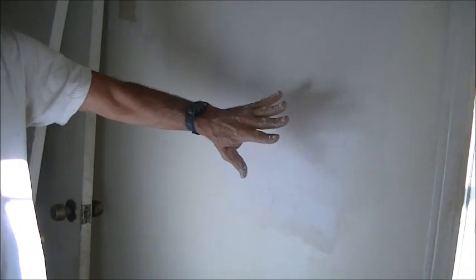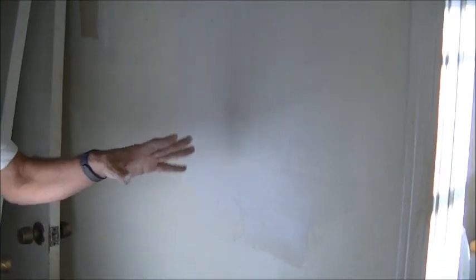If you notice going over the passes that you still see a little bit of tape, you're okay, as long as all that's smooth. The same at the top. You want to smooth it out. So right now, it looks like it's finished. Of course, tomorrow when it dries completely, we'll take some sandpaper and do a very light sanding, and then it's finished. We're not chasing sand, as I like to call it. Chasing sand is when you have too much sanding going on and it doesn't work.